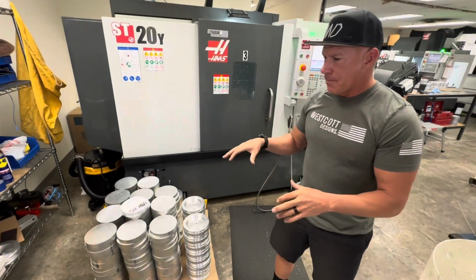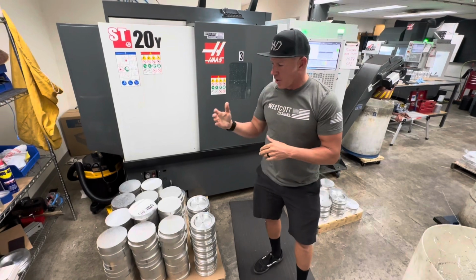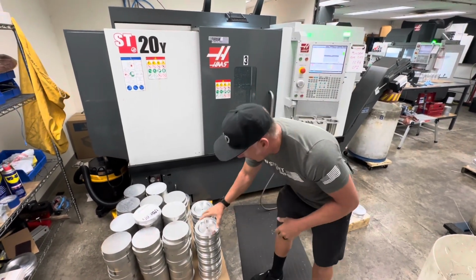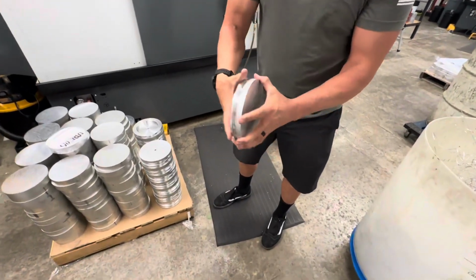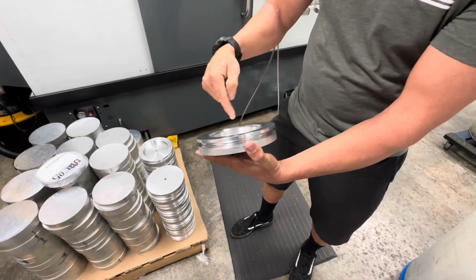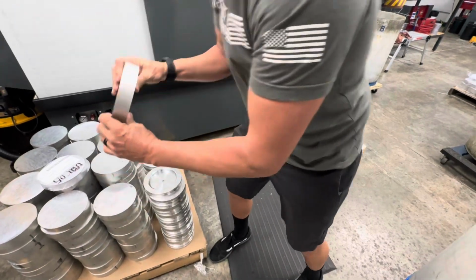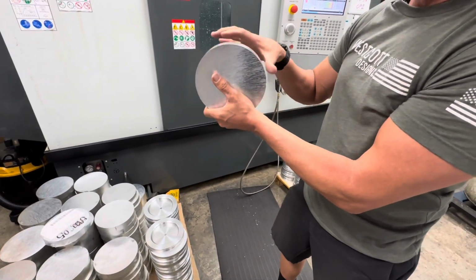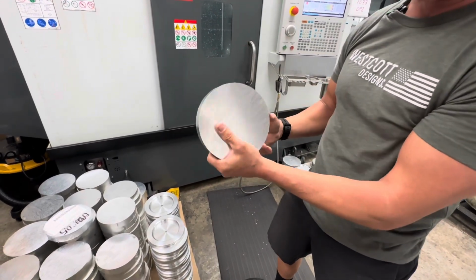So we're up here. This machine is actually producing all of our rear pucks for the 4Runner, the Tundra, and the Sequoias. Our rear pucks, the first phase is done here. We hold it in the machine like this in a clamp, and then we machine all these parts, and we machine the inside out here. They start out in a solid state like this. We have this shipped to us on a big reel, but they cut it so we can handle it so it's not too large.